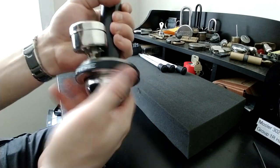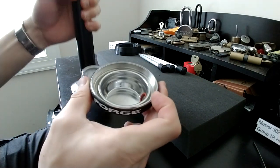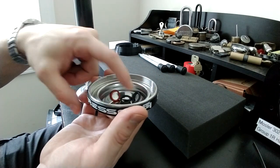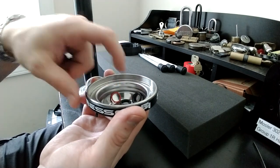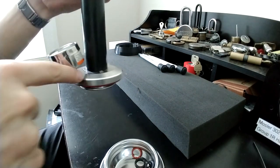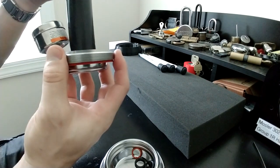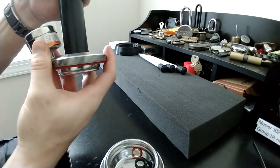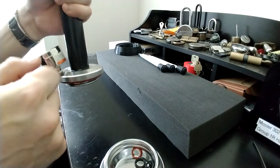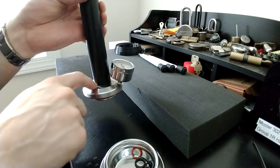Any of your small accessories on the forge will be inside the basket. If you didn't order any extras, you get two piston sealing o-rings which are the black ones — you can see them on the piston — and then you get one red one. Keep that one; it is used for sealing the tube to what I call the top plate. Inside there, if you were to unthread the top plate, you'll see there's an o-ring attached to the tube at the very bottom. You can see pictures on my website, but that essentially keeps water from leaking out of that area.